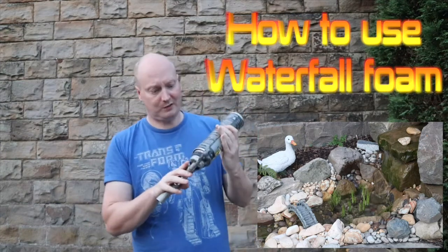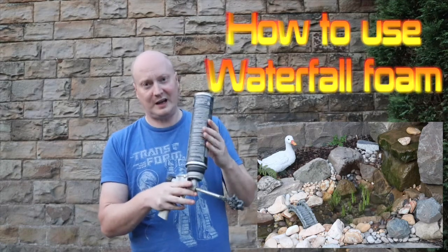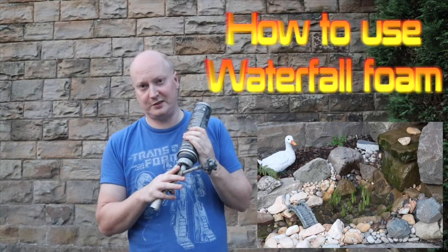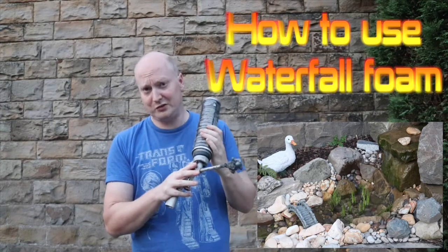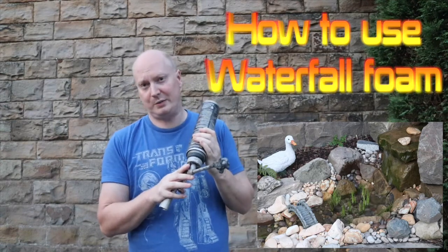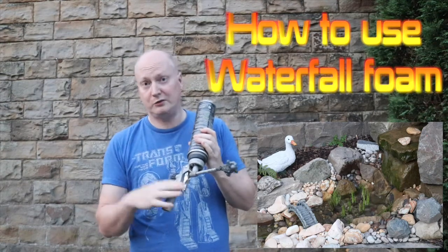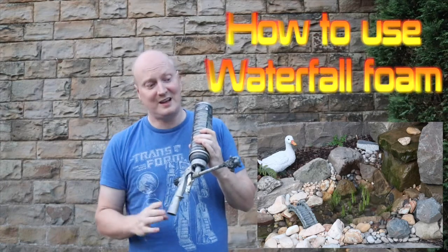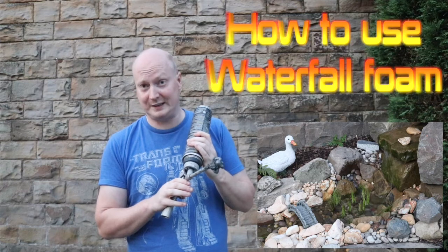So I want to talk about landscaping foam in particular. It's known as waterfall foam. It's generally black. It's slightly different to the stuff you buy at the hardware stores, which is yellow. It doesn't expand quite as much, and it's very pliable after about 4 or 5 minutes, and generally you can push it in with your hands. Always use gloves, please, because once you get this stuff on your clothes or your hands, it's almost impossible to get off unless you've got a foam cleaner.